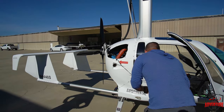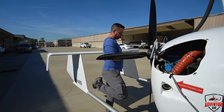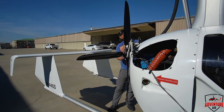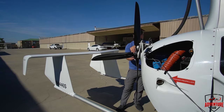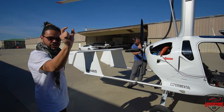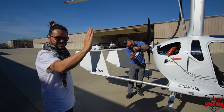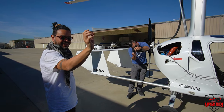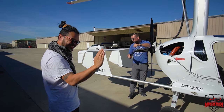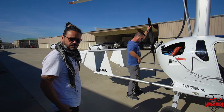What's next? Weights? Not necessarily. It was wobbling a little — like the pitch wasn't proper. They're in and out of phase. When you look at the propeller right 90 degrees when it's spinning, you should see just one shadow, the exact shadow of the profile. If you see a little bit of distortion, or it's opening like a small shadow or off focus, that's when one of your blades are not aligned. And these little bits make a huge difference when you're flying.